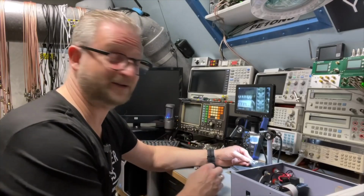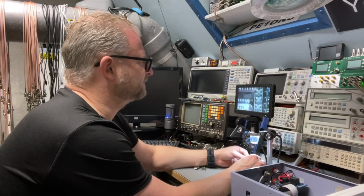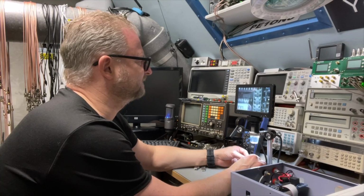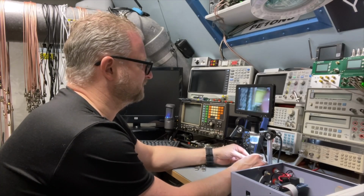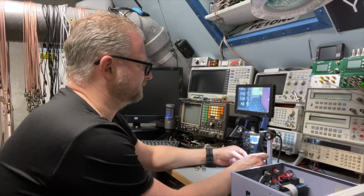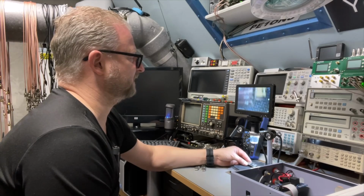Okay, I did find my converters. And it is indeed CH340. This is one of the latest generation, the G version. I do see one jumper in the bottom, and that is for switching it from 3.3 volts or 5 volts.